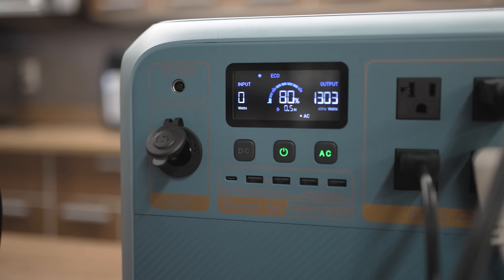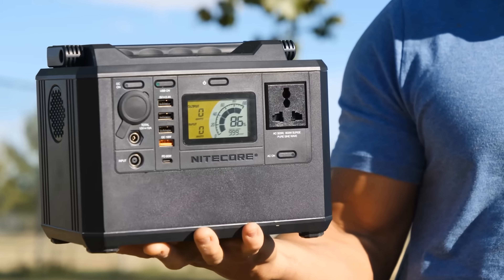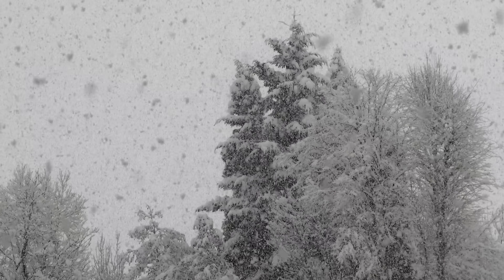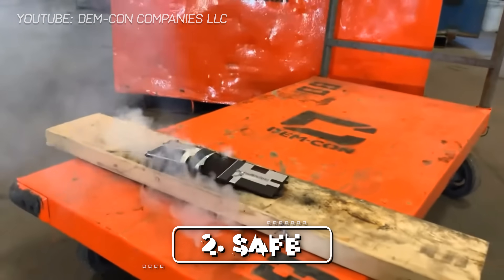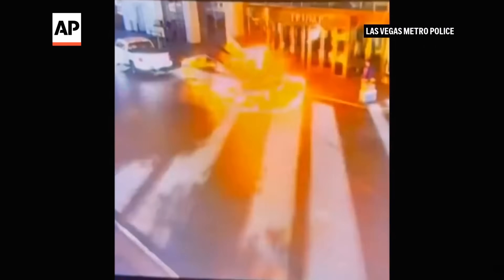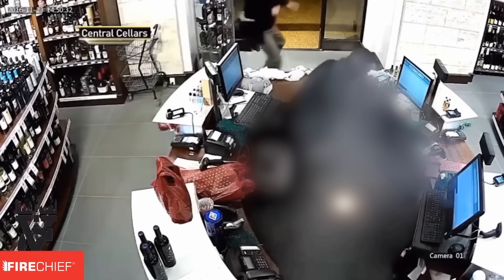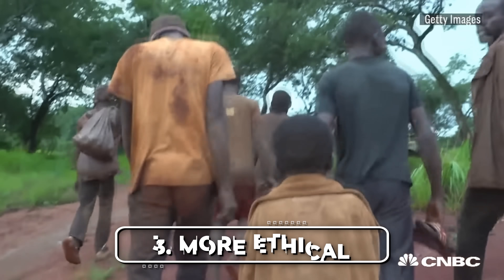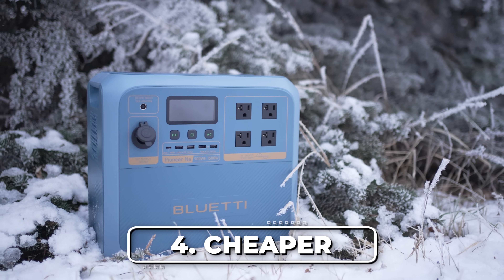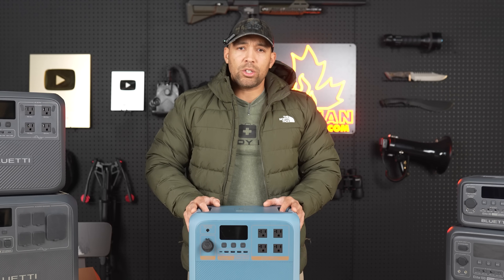There's four general reasons why you'd want a sodium battery. Traditional lithium ion batteries and other types of lithium batteries — you can risk damaging your battery in the discharging and recharging in cold conditions. That's not a problem with good old sodium. They're safe, so you're less likely to have that thermal runaway explosive effect — the blowing up Teslas and guys getting trapped in elevators with their e-bikes exploding and vapes exploding in people's pockets. You don't have to worry about that with sodium. You also don't need to use things like cobalt, which of course is an industry that is mired in ethical controversy. And it's also much cheaper because sodium is abundant — it's pretty much everywhere on the planet. The biggest drawback is that the power density is much, much lower.